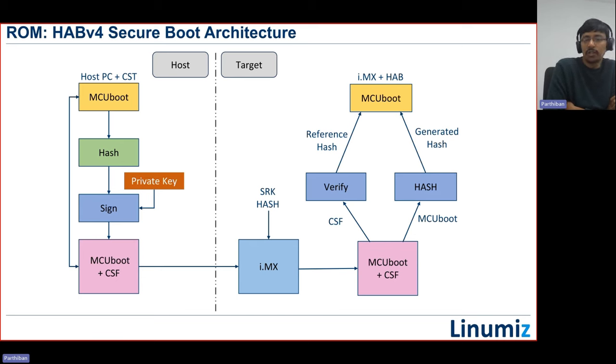Two important points when using i.MX specifically: first, MCU boot is copied into OCRAM for the verification process, so this is restricted to the size of OCRAM, which varies from one NXP SOC to another. The MCU boot stripped-down configuration typically fits within 32 KB of storage, which should be enough for achieving secure boot with High Assurance Boot. Second, the device needs to be closed — meaning a set of other key fuses must be burned so that the OTP keys cannot be tampered with, making the device completely secure.